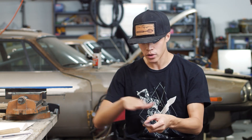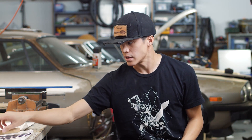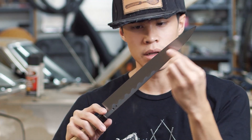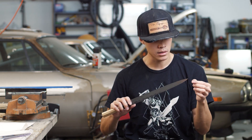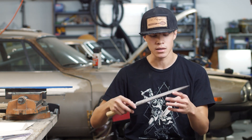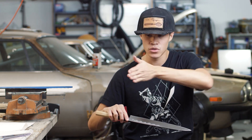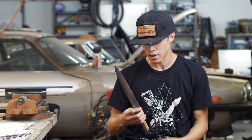The next big problem is the hollow grind — the Ura on the backside. I was actually fearing this part even for a simple radius, because trying to get a sharp, crisp rim on the edges is something you can see on a good knife — the rim on the Ura is super crisp and narrow and it seems like something you have to practice for a long time to get clean. Now that I've learned it's actually not a simple radius but a sort of compound grind, that changes a lot of things. I'm just going to have to try a bunch of stuff — I have no idea how it's going to go.